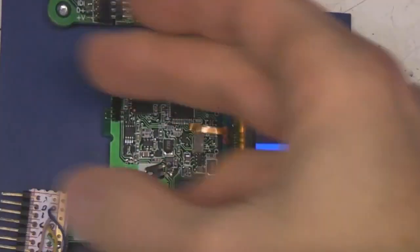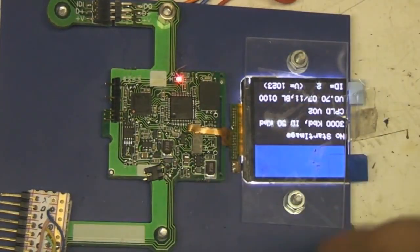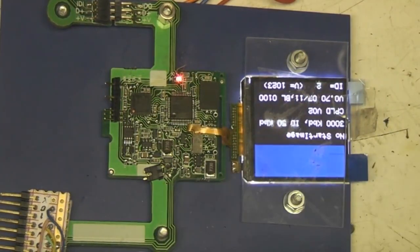One of the things I want to look at is close-up work, because obviously a lot of people are going to be interested in using this for electronics. I'm going to look at a couple of options to make the thing focus at a closer distance. This board is about 40mm square — it's got a couple of DC-DC converters on it, so there are a few things at various different temperatures. The normal focus range of this thing is about half a metre before it starts getting blurry, so for a small board it's not really quite close enough.